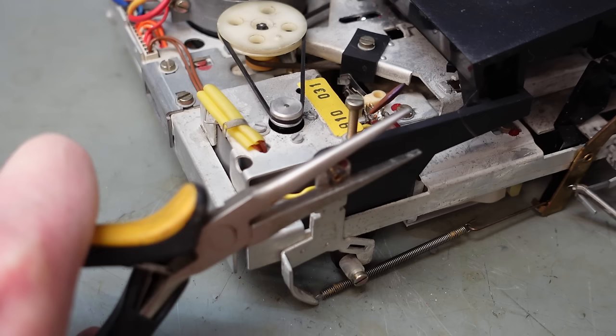We've got a pulley there. That's supposed to be driving something else, isn't it? Let's have a look at what that pulley's supposed to engage with. Ah, of course, there's a pulley here with a magnet on next to a hall sensor. That's how it knows. Oh, what's that in there? Pulley's full of crusty old white stuff. What is that? I've seen sticky old black stuff, which is old belts, but I don't think these belts turn into chalk or something. No. Oh, and it even flies off when you spin it.